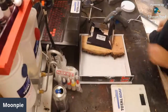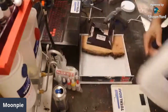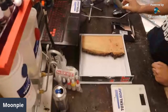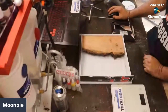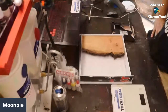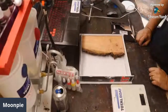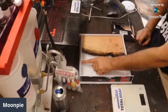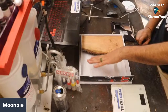The reason I'm going to have to do a couple of pours is we are going to use some Total Boat Thick Set, which you can make larger pours with. But this is going to end up being a very, very big pour. I don't believe we can just pour one big pour — it'll end up cracking. And I'm not going to be able to put it in a pressure pot either, so I'm going to do probably a half-inch pour and then come back later and do another half-inch pour.